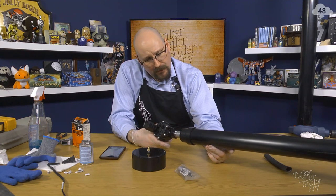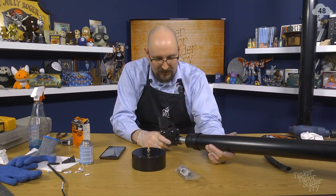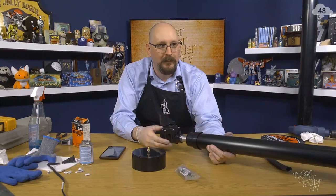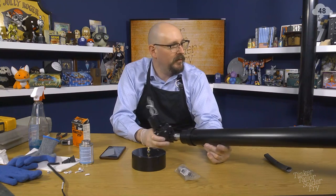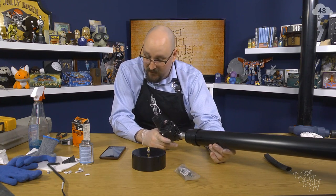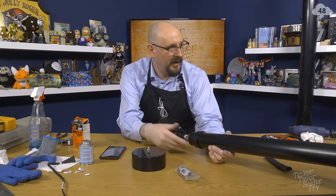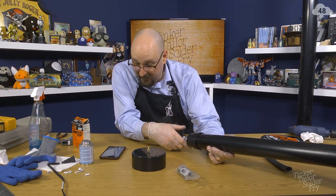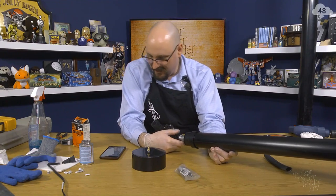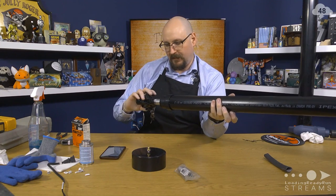I do have trigger discipline at the moment — this is technically the trigger, and connecting those wires would do nothing right now. I think for the electronics we're going to go with three nine-volt batteries in series to create enough voltage. I've been told these solenoids have no problem handling the extra three volts — 27 volts total. Nice thing is we don't have to glue these connections together, so we could swap out the valve if it became a problem.